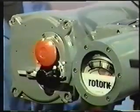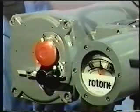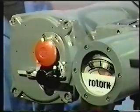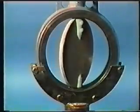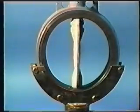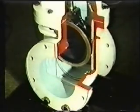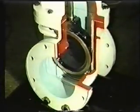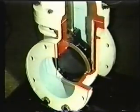A motorized valve actuator must be capable of halting its operation precisely at the fully open and fully closed positions. This butterfly valve is one obvious example of where precise stopping at the two limits is important. It must be capable of applying additional torque or effort where necessary.